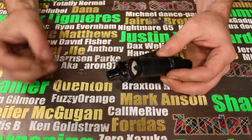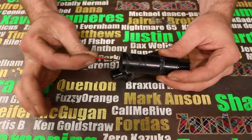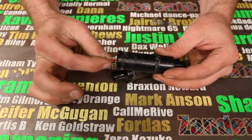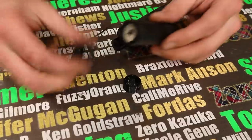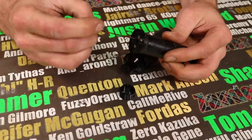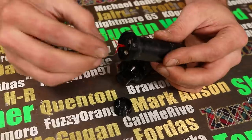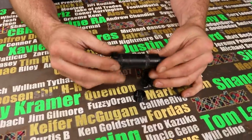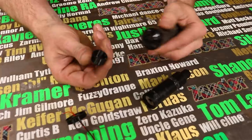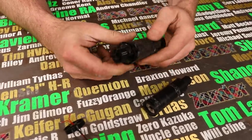Next was the rockets misfiring. The igniter has to be completely bottomed out in the rocket — if it moves back even a little bit, it doesn't go off. When the launcher was being handled or the tubes were spinning, that little bit of motion was causing the igniters to back out. So I invented retainer caps for the different rocket motors that snap on, and once the igniter is bottomed out I can glue it in place. When thrust goes off, it blows the cap off. These tiny 3D printed parts mean no more misfires — ever.